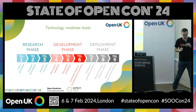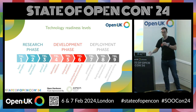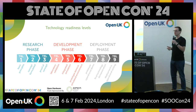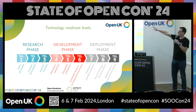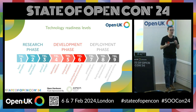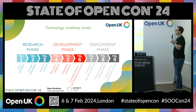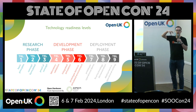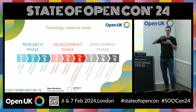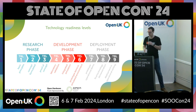So why are we doing this? We think CHERI has the potential to really get into deployment. But to get there, you really have to go through the technology readiness levels. There's been more than a decade of research done at the University of Cambridge and SRI International, really in the research phase — levels one through three. And lately, in the last few years, there's also been a lot of work on the development side. For example, Arm published Morello, which is a CHERI modification of the Arm ISA, and they've also shipped some development boards. We believe that with Sonata, we can bring a lot of those benefits into the open source — creating an open source platform, an open source board, but also software, verification, et cetera — and push this from the development stages into the deployment stages. That's what we hope for both Sonata and eventually Symphony.